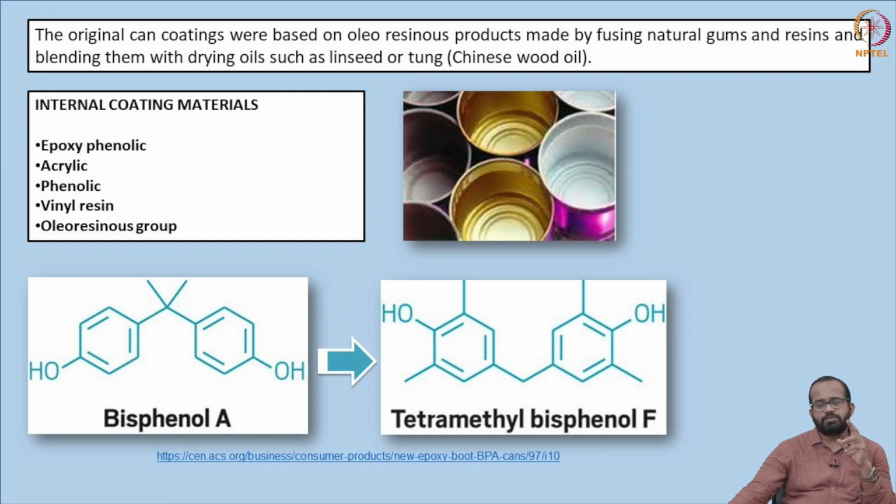It's called C enamels. So there are basically two kinds of enamels. One is acid resistant enamels, that is regular or R enamel. Then there is sulfur resistant enamels or C enamel. C stands for corn, because the sulfur resistant enamel was initially developed for canned corn. Different kinds of these lacquers have different colors as well.